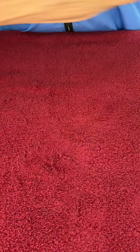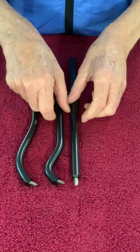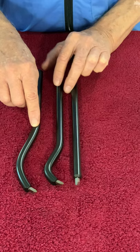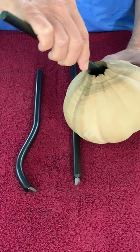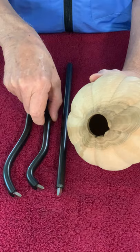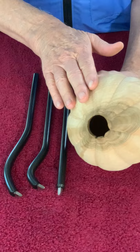There's also a set of half-inch tools that work exactly the same way — they have the same kind of cutters, three-sixteenths square. We have the equivalent of the number one hook tool, and last year I started making, on request, a longer hook — a number two version — that will allow you to get farther over into the sides of pieces. These are useful for pieces up to about five or six inches, with enough mass to not chatter. With a light touch you can push another inch or two beyond that, but we generally recommend them for five to six inch pieces.